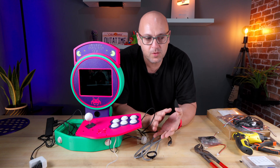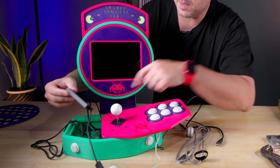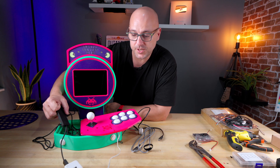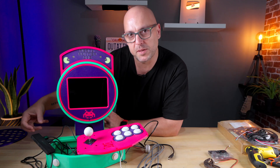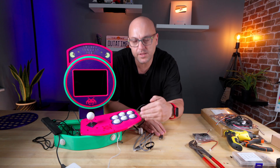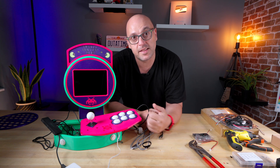The amplifier was also giving me a bit of crackling and interference. So what I decided to do is modify it slightly — the power to the Pi will only power the Pi and the screen. For the rest, I'm going to install a USB hub where the speaker amplifier and the LED strip connect, and that will connect separately to a USB charger. That seems to have solved all my issues, but there were a couple of speed bumps along the way which now it's time to fix and get this up and running.